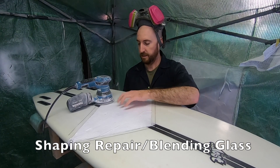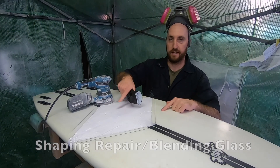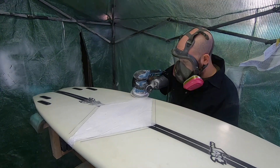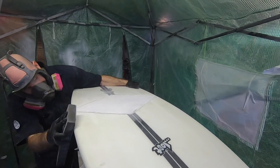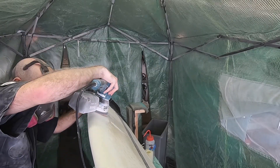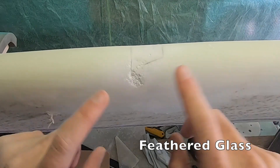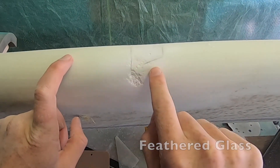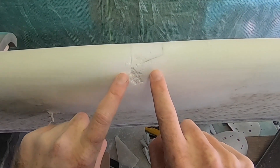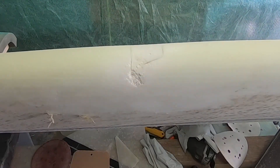The Q-cell resin has mostly cured. I'm going to start feathering in the glass for the repair and then go back and shape it. In hindsight, I should have done the feathering before the filler, so I'm going to have to do another coat of filler on this one. You can see these little bead outlines where I sanded the glass really nice and feathered it in — that's the appearance you want to go for. I'll get that look on the rest of it and then do another filler on the remaining divots before we glass it.